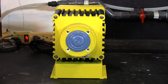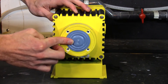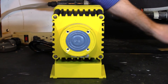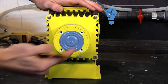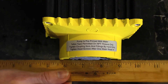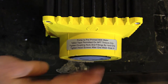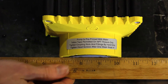Then you'll need to turn the pump on again and screw it in a little bit farther. With a straight edge, the center of the diaphragm should be flush with the outer lip — the outer casing of the pump. You can see that's not flush yet. Flush.